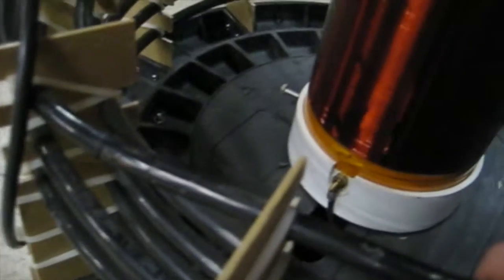Here's the primary — it's 1-0 wire. The way I tune this coil was that I cut little slits into the wire insulation, and then I'd connect a tap to it to see if it's at the right resonance. You can see I made a few slits — I tested it a few times.